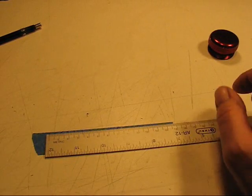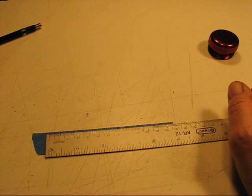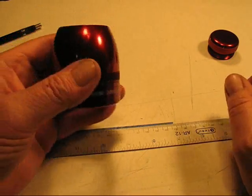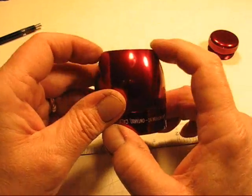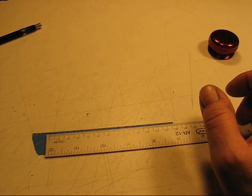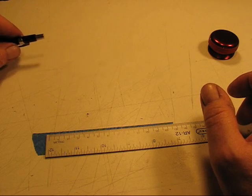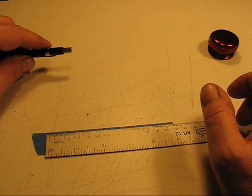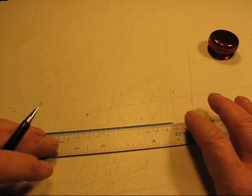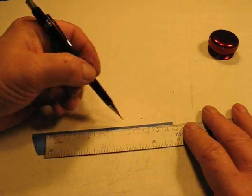Now I can tell you already from doing these that a tail cap will measure 124 millimeter. A bezel will measure 178 millimeter, and if you happen to do, which I'm going to do on this one, the bottom of the head also measures 124 millimeter. So I'm going to do 5 crenulations, 5 cuts. So I'll just divide it out, and for 124 millimeter it's going to be 24.8, and all I do is go through and mark on my tape 24.8 all the way through.